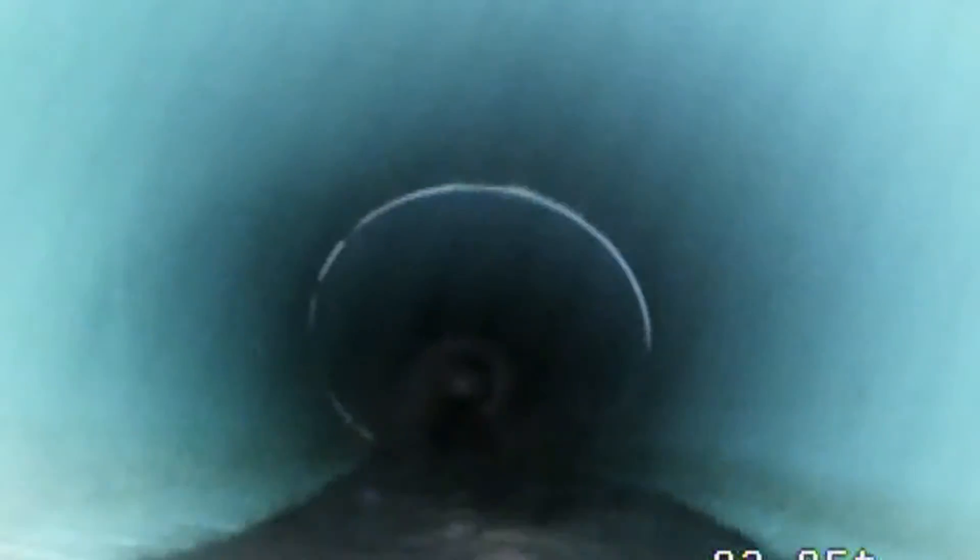I saw the offset with some more roots coming between the clay and the PVC. It looks like they didn't use a proper transition. As you can see now, we have a way better flow. A lot of solids and waste are just flowing down here. I don't like the solids, but I like the way it's flowing.